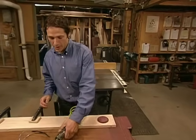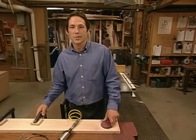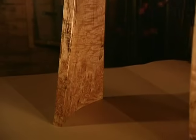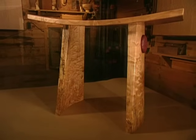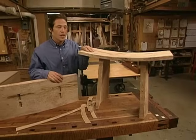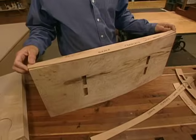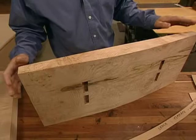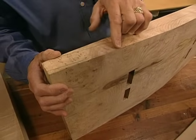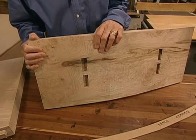We're just finishing up carving with our small bit on the die grinder, and our purple heart disc is looking good. Now we're ready to start carving the legs and seat of our sitting bench. It's the curved profile of our seat and legs that gives our Japanese inspired sitting bench a true sense of elegance. To achieve those curves takes several steps — we'll start by taking the bench seat template and making some layout lines, then take this to the band saw and rough cut away the top portion of our seat. On the bottom of the seat, we'll make a cut partway in but stop around the mortises, keeping that flat spot to maintain the tight fit of our joinery.